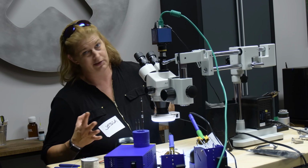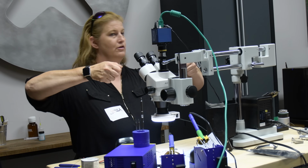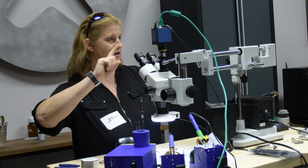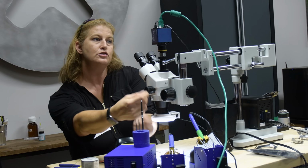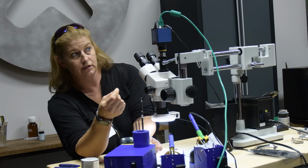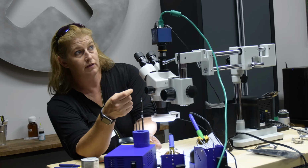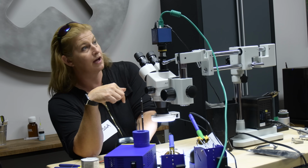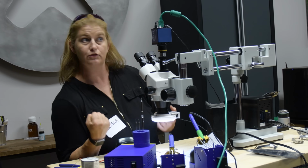Like right now at your house, back at home, you probably have the sink turned off in your kitchen. If you were to take some kind of device and measure the water pressure back behind your sink, would there be water pressure in the pipe behind your sink? Yes. Water pressure is present. Now what about current, flow? Do you have any flow right now? No. Hopefully not. So pressure, voltage is just that push, but it's not going to do anything.